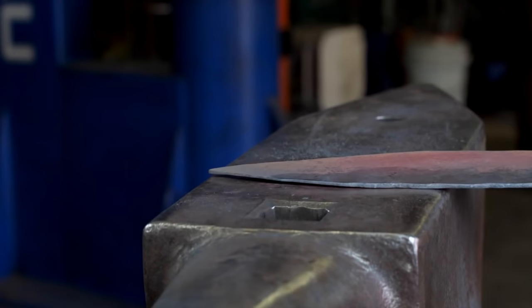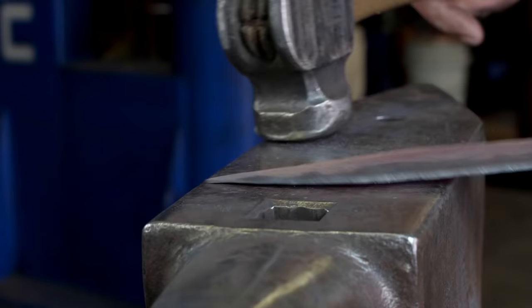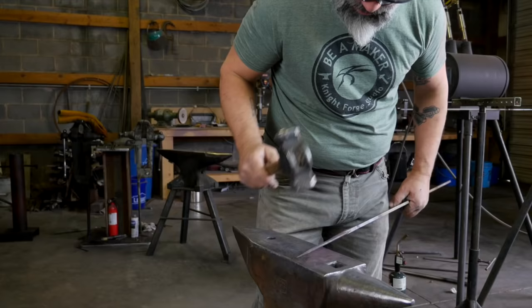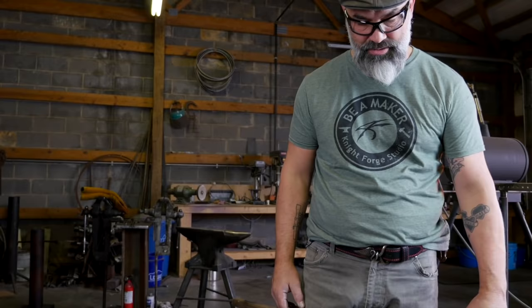Now I'm planishing — I'm not hitting it very hard, I just want to make it smooth, get a nice even finish and make it straight. There's no magic in hitting steel at this temperature. The idea is just to get it smooth — I'm not grain aligning or edge packing, none of that's happening. Only thing that's happening is smooth and centered.